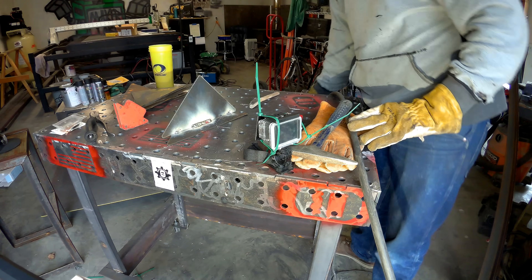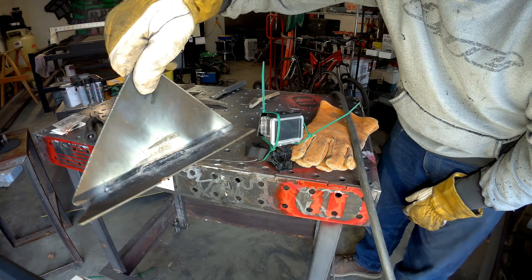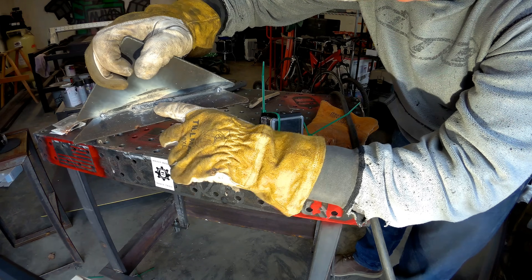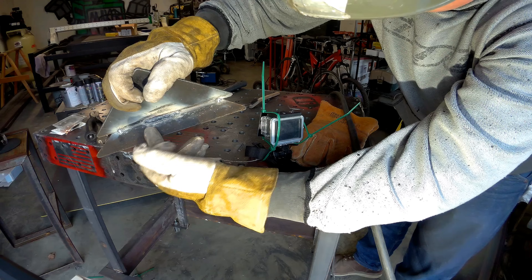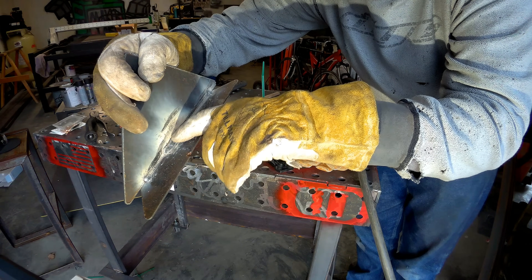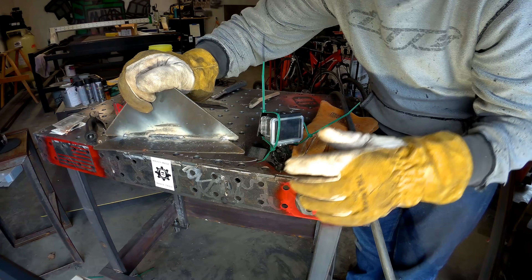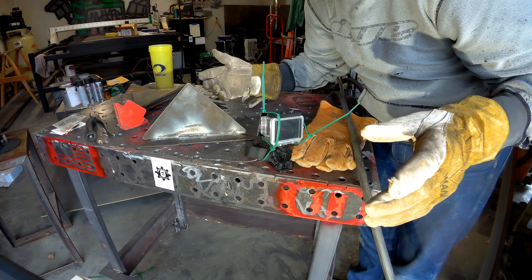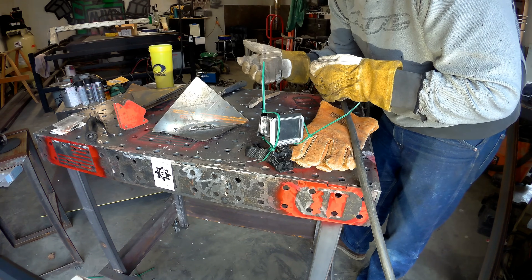I slowed the wire speed down by five inches per minute. The factory settings were actually a little bit better. I started hitting my tempo right about here where it flattens out and that looks really nice. But in the beginning my arc length was too long, which means it was too cold — I know because it sits up taller and lumpy right here. The flatter sitting weld is better and I didn't change the machine at all — this is all just about technique and how you can improve a good running welding machine.